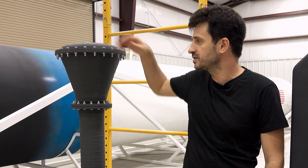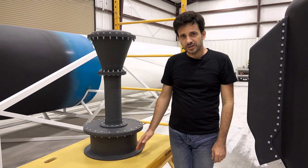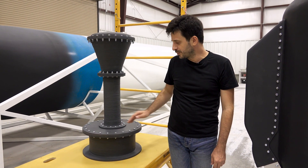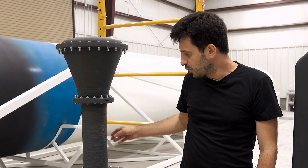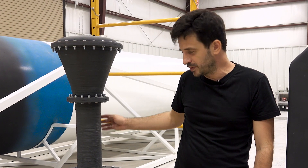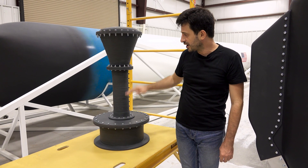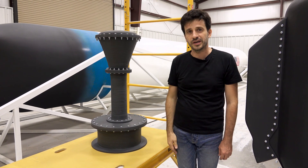The injection head has on top 425 injectors. We are using in the tank a pressure of 20 atmospheres, and between the pressure burst discs a pressure of 10 atmospheres. When we want to start the engine, we have a valve here on the conduit that is releasing the pressure between the burst discs. The disc will break and will allow the hydrogen peroxide to go inside the injection head and from there into the engine.